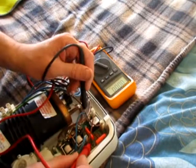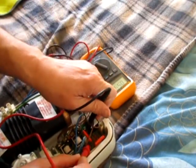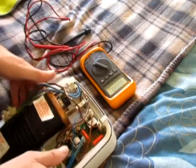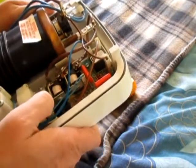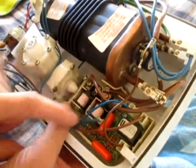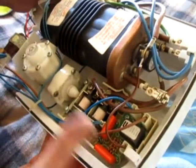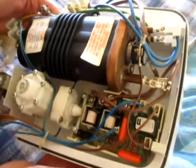Here's another one here - that's closer to its rated reading. But basically I'll take that board out and have a good check of it. While it's out, I'd also clean up the relay contacts and probably test them by putting power to it and making sure they're opening and closing. Better to take that board out though, but I'm not going to do that today. That's it really.